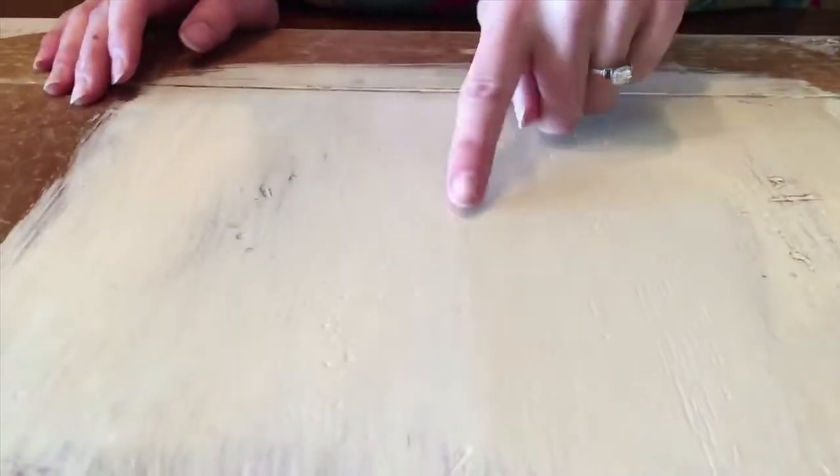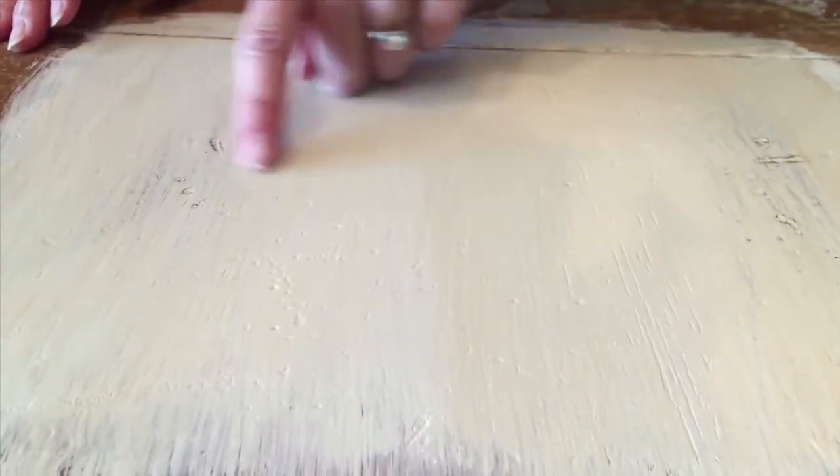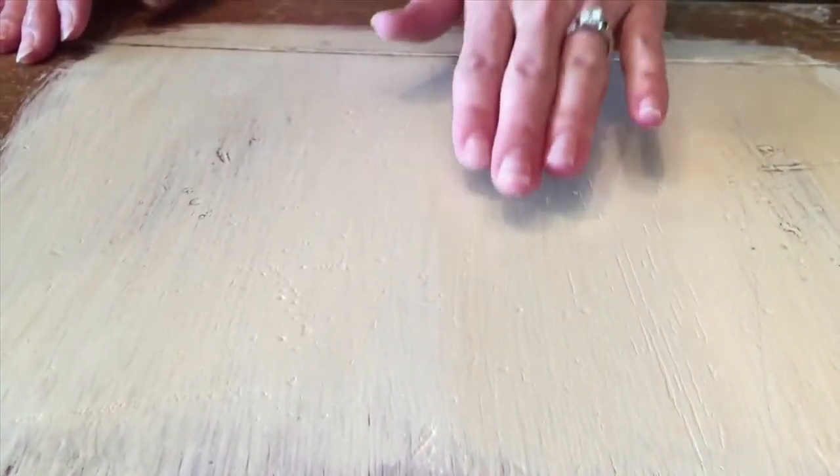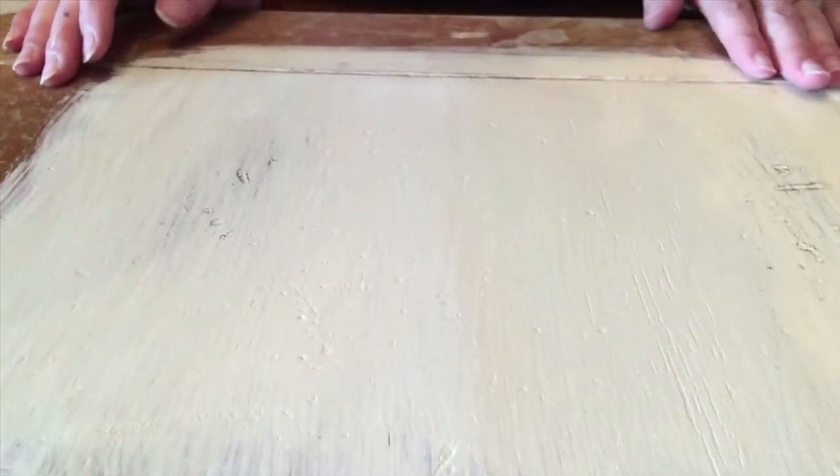We're finished — I did the third top coat and let it dry. The top coat isn't super obvious, but you'll see this side has a little more sheen; I used semi-gloss, versus this side which is a little flatter. This has a protective coat and it looks really nice. This was just an example of how to do milk paint — I didn't finish the whole table, but this is what we're doing to the cabinets in Lulu and I can't wait to show you the end result.